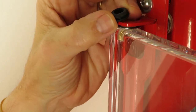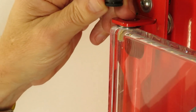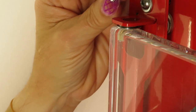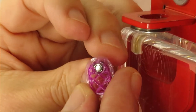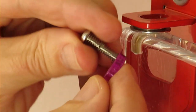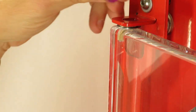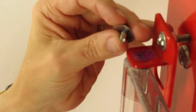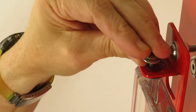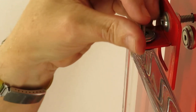Originally it had these little grommet pieces in the hole, with the screw in it so that it could slide in and out a bit as the vacuum was pulled. These had a little bit of an issue there, so I used some flexible plastic and 3D printed a part to go in there instead. It's very squishy in this direction, but it fills the hole completely and still allows for the movement, and the screw with the washers to go in there. Because it's a flexible plastic, it can squish right in there as the door gets pulled in because of the vacuum.